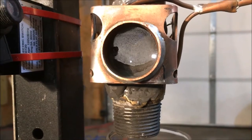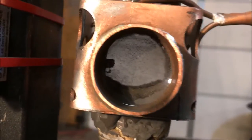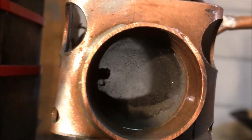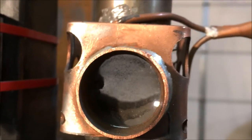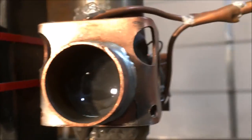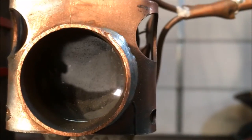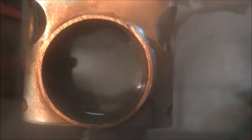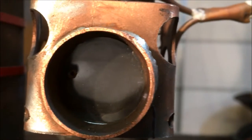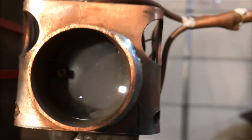What we're looking at here is a sight glass on my auger fuel feed for a charcoal gasifier. You can see right there are two little copper tubes that are sticking up inside of there, and what those are is air spuds that allow me to clean this lens off. I'm going to give a little demonstration of that real quick.